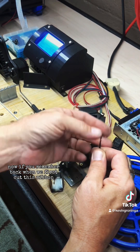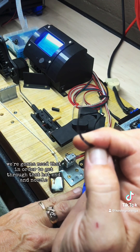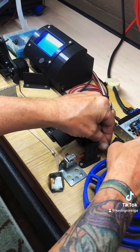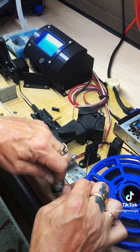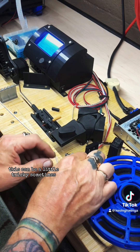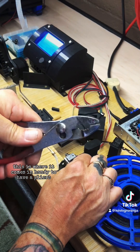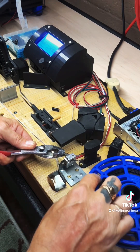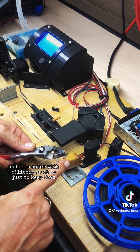Now, if you remember, back when we first cut this ribbon, I said that we needed to have a tail on here. You see that long, thin tail? We're going to need that in order to get through that hot end and nozzle. So let's wrap this through the wiper, pull this through, and I'm going to take that long thin end and put it through the hot end and nozzle. This can be a little tricky sometimes, and you'll see just a little bit of this poking out. This is where it comes in handy to have pliers — go ahead and grab that little bit of ribbon that pulled through. I'm going to put this cover back on my hot end.